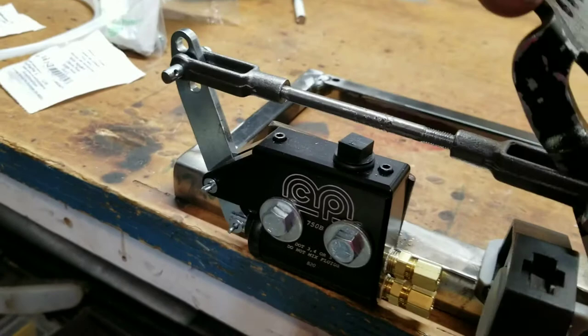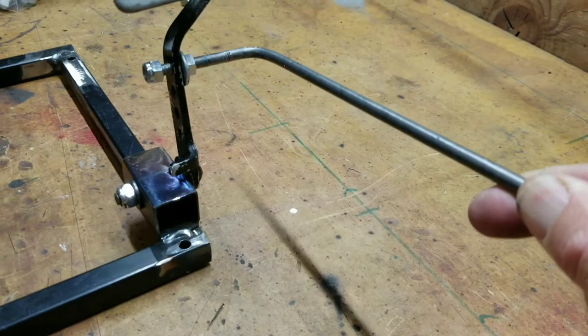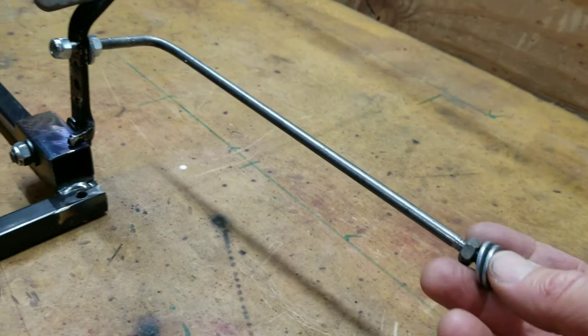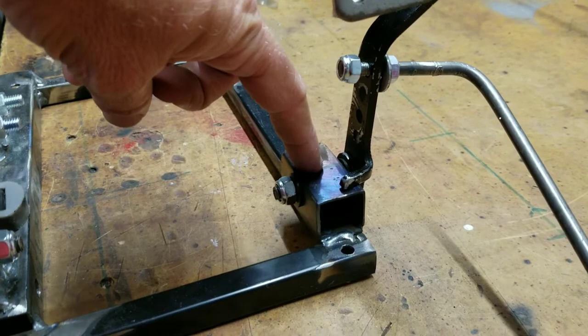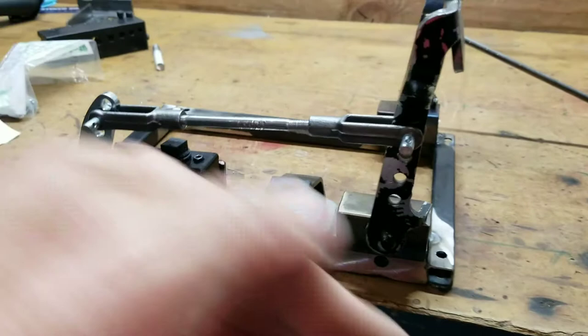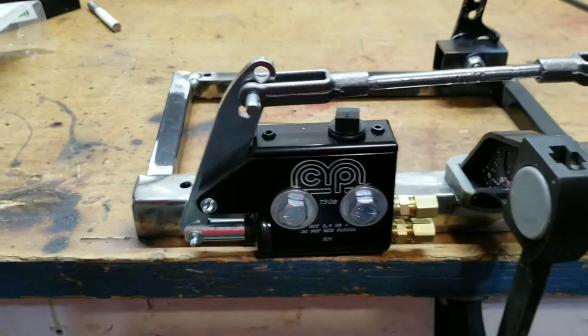Your gas pedal, same thing — it's got this little stopper for forward travel. We're using a rod. I just took a quarter-inch rod and bent it, and I ran quarter-by-28 thread on here, and quarter-20 on down here. This rod gives you your throttle pedal, and this is where you're going to hook the cable to. This may look a little goofy because I've got this thing on top of a half-inch rod. The reason I did this is because the pedals need a one-inch spacer — there's a spacer on the pedal assembly itself that really needs a one-inch piece of metal on both sides. I had to elevate this side so it didn't interfere with the cap. If I put the pedal down low, it would be running uphill and interfere with this. I gave it enough room so it goes up against the front of the foot box and won't touch it.